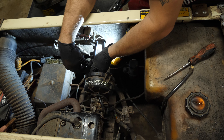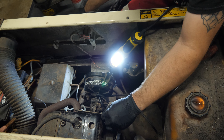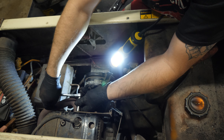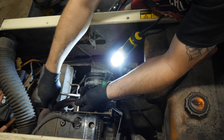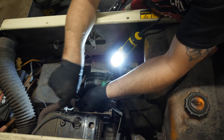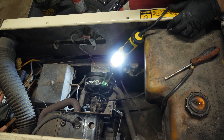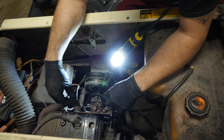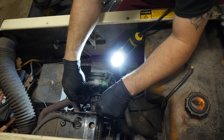So once you get your bolts tightened down, be sure to bend back your safety tabs. That's where my knowledge comes from. Before I worked on the golf course, golf course equipment is some of the weirdest looking, most powerful, and most complex but simple equipment I've ever worked on. Most of it was Toro. And they use these springs — basically to take up the slack, so there's no play between the two linkages. Just keeps that slack tensioned.